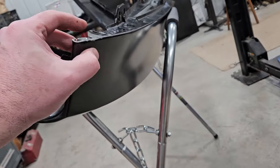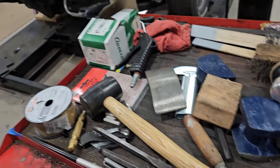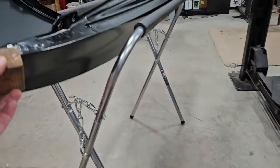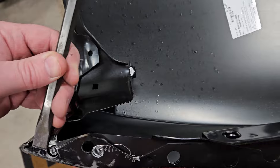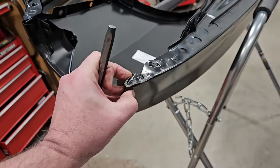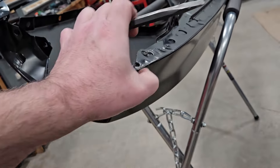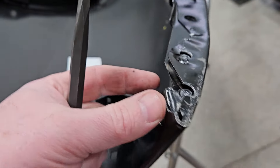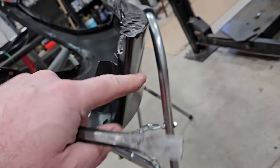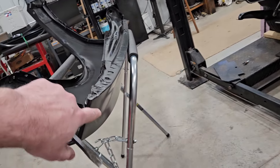We've been working for a little while and it's starting to come together. I'm using some not-super-sharp chisels and a small smacker. Originally I was trying to back it, but what I've actually found works better is I place the chisel, put my big fat belly here, and kind of relieve it — it seems to want to go back to where it was. Not only tapping on the end but holding this and tapping on the high point, kind of pushing and arching it back out. This is already such a giant improvement and I haven't even gotten in here and dollied any of that out yet. I think this was the right approach versus grinding it all down and filling it in.